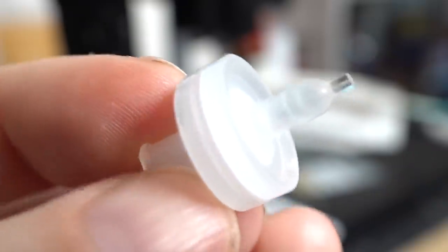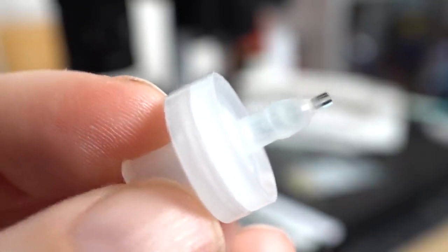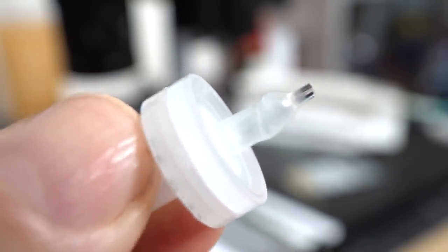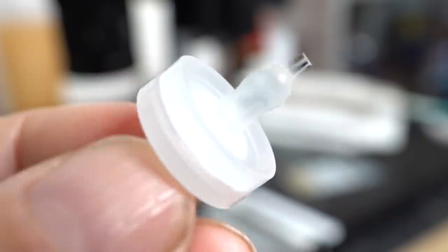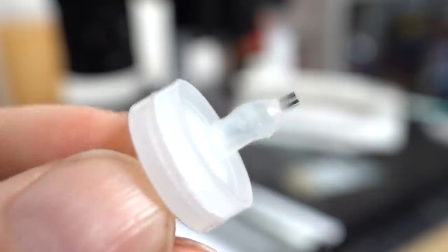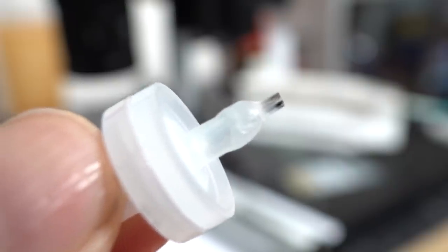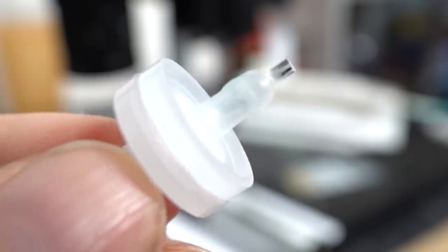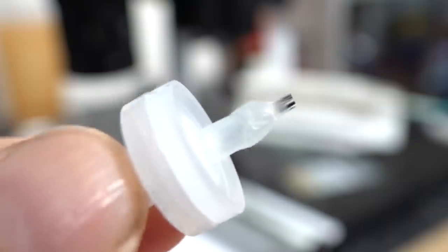These we've happily run up to 5 bar, and at that point there's just no point in running them any higher because it's fit for purpose. We've never really had these things fail — they've got a very high success ratio. So that's basically how you make these integrated nozzle filters. They're dirt cheap to make, of course — it's the cost of the filter, which is a couple of bucks, and the cost of the glass, which is essentially zero. We've never really had one of these not start, and they don't really ever clog. They're absolutely fantastic.